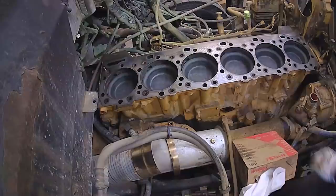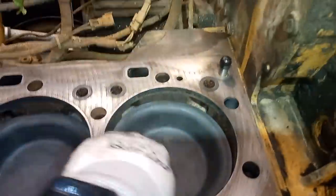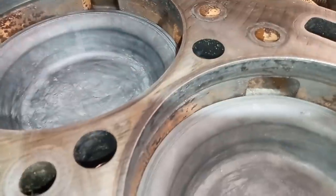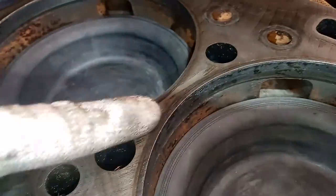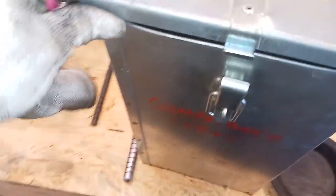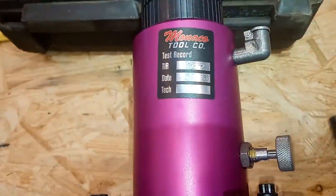We are now prepared. I use these brake chamber plugs — diaphragms — and they work great. They fit right in the cylinder and they'll catch pretty much any metal that would fall deeper into the engine. The pan's off. I've also installed earplugs in the oil ports on the rod journals on the crankshaft because you don't want to get any metal in there. This is our Monaco counterbore cutter — that's the box, and this is the actual cutter itself. Very nice tool. I've used the Cat-branded one also and a Cat pneumatic one, and I've had much better luck with this one than the Cat one.